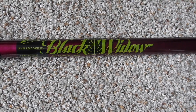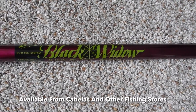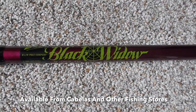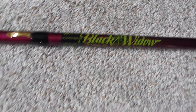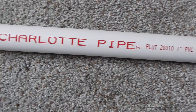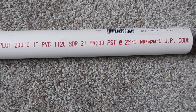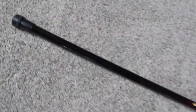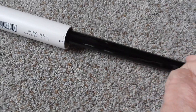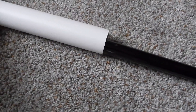Like the original design, the new antenna uses the 10-foot three-piece Black Widow telescoping fishing rods. What I'm using to mount the rods is this low-pressure PVC pipe. It's one inch in diameter, and the cool thing is that the fishing rod fits right inside that tubing, so it makes for a nice mount.